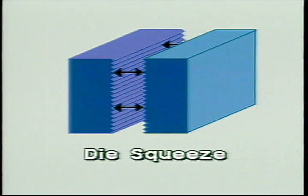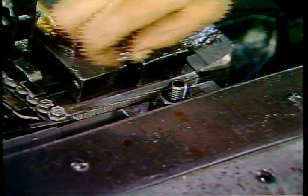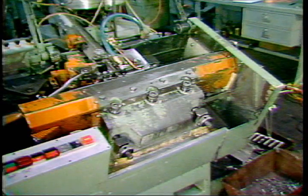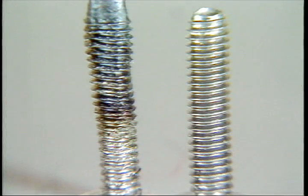The next adjustment is to fine adjust die squeeze. After the dies were installed, they were rough adjusted until the blank fit snugly between them. Now that the dies are matched, you must fine adjust die squeeze until the dies produce threads within tolerance. Start with a minimum amount of die squeeze, then gradually increase it to prevent overloading the dies. Overloading means rolling blanks with too much die squeeze, which forces too much material into the die thread forms and will damage or break the dies or damage the machine.